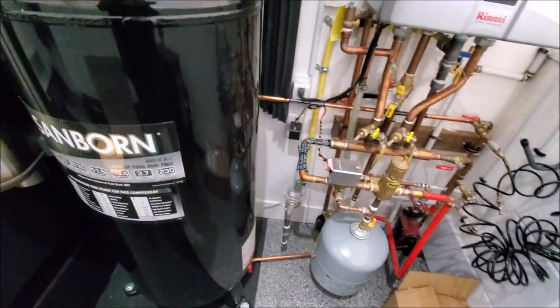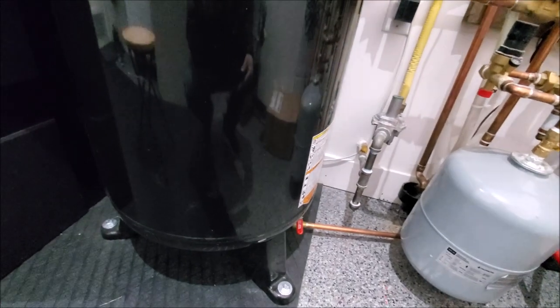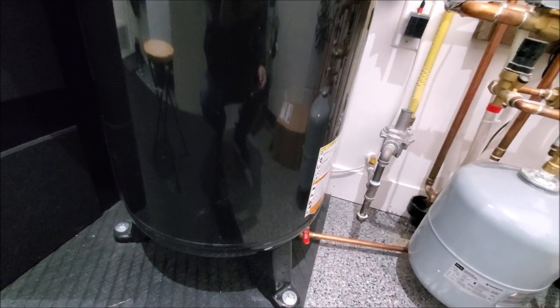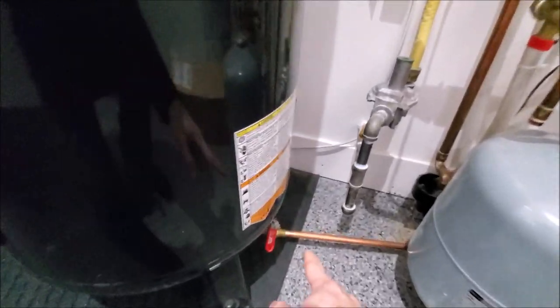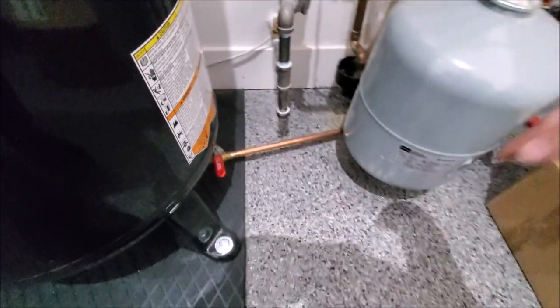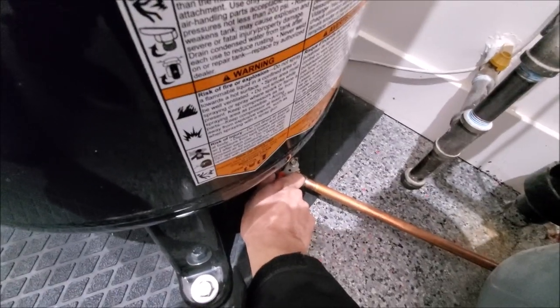While I'm upstairs, I'm going to show you our drain system. People often don't drain their air tanks because it's not easy, so we did the extra legwork to make it easier. We have a valve here and a copper line that runs through the mezzanine — I'll show you downstairs where it ends up. We're going to open it right now to drain the tank and we'll see all the water come out.